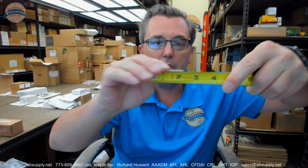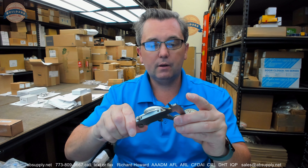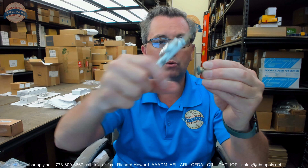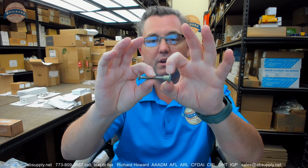The length of the bolt is about two inches. The grommet nut diameter is 0.382, with an OD of the head of 0.623, and the thickness of the head is 0.134. Nominally you are going to be drilling a quarter-inch hole on one side and a three-eighths hole on the other side. If it were me, I would probably be drilling a hole slightly larger than that — I would use my wire drill index and go to a wire size about twenty thousandths larger, just to give myself a little bit of movement of the bolt. Otherwise, you are going to be in there filing the hole a little bit.